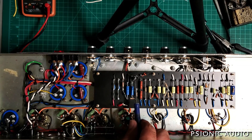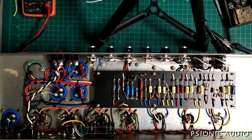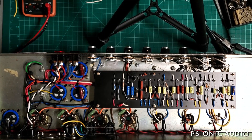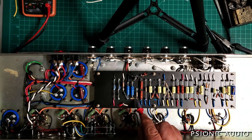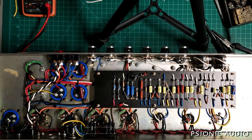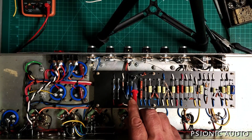I'm going to turn that about halfway. Before I put tubes in, I like this to have about negative 40V. I have the bias limiting resistor off the bias tap at 22k, which is one of the possible vintage values. Right there, that puts us at 47V. The range of negative voltage I want is mid-30s to mid-40s, and with adjustment I'm getting to 42V. That voltage will change a little once there's a load off the secondary, but not by too much. That tells me the 22k is probably going to need to be increased — the other vintage value is 27k.